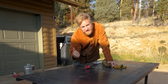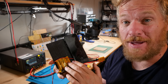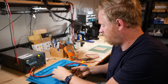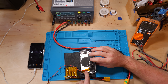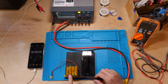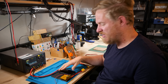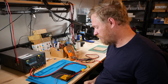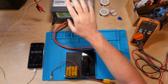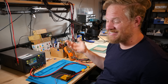Let's head back inside — I think we're done with the LiPo batteries, but I have something else to try. These here are lithium titanate batteries, and they're supposed to be one of the fastest charging types of battery chemistry. I've built a small battery pack out of four of them to hook up to the iPhone, which I've removed the standard battery from. I've removed the stock battery and took the BMS off of it, just hooking up two wires to where the cell would normally be. This is a little step-up voltage regulator. The max voltage of these lithium titanate batteries is only 2.85 volts, whereas a normal LiPo cell in an iPhone is around 4.2 to 4.3 volts. This voltage regulator steps up to 5 volts, and the phone seems to tolerate that just fine. It's set to 2.85 volts, maxes out at 10 amps, and these cells can be charged up to 5 amps each — wired in parallel, that's 20 amps. We're going to charge at 10 amps because that's what I've got here.